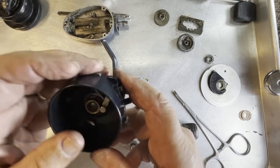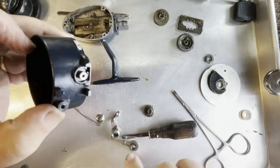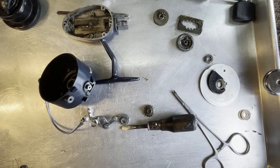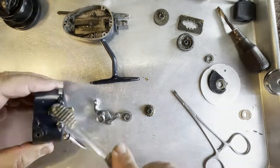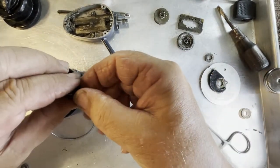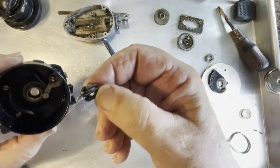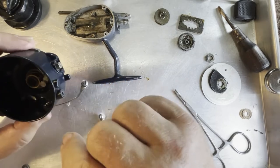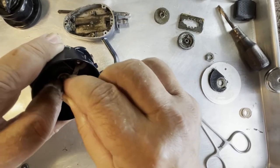See those teeth? Those teeth are what are going to ride on this gear right here. We're going to clean that up and try putting it back together — that should be interesting. I almost made a major error right there. This is the bearing assembly, and I was cleaning it out with a cotton swab and I pulled it out. If all those little roller bearings had fallen out, which they tried to do, I would have had a lot of difficulty getting that back together. So make sure if you're cleaning this out with a cotton swab, hold that in as you clean it — see all the dirt in there?